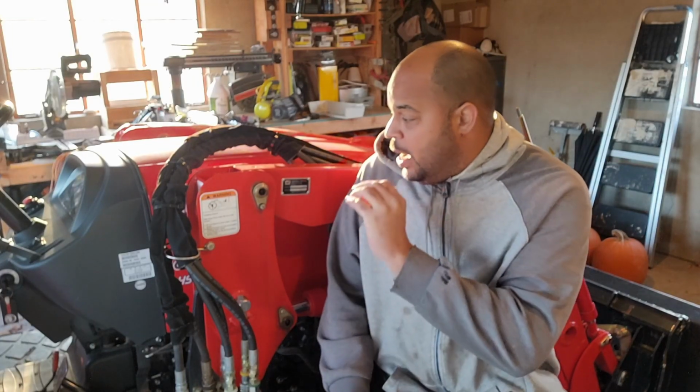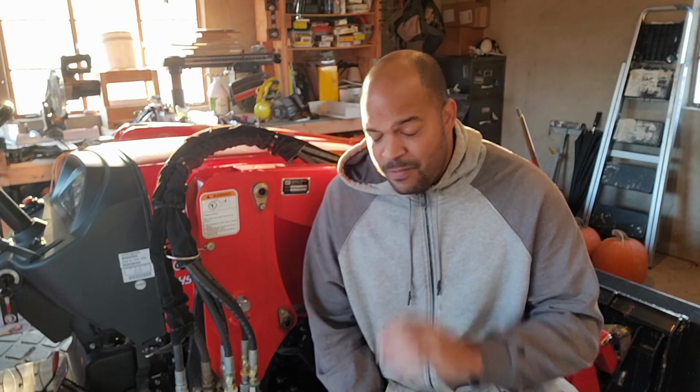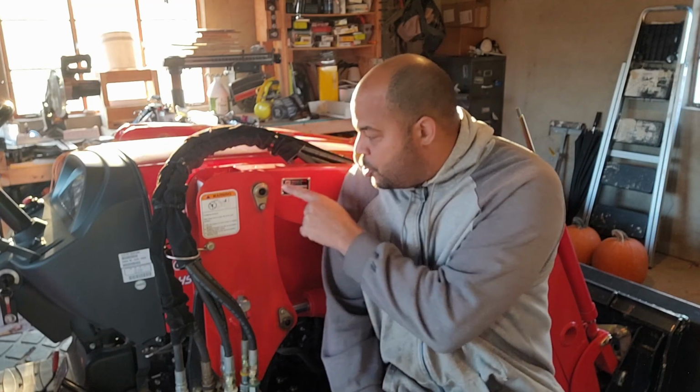And I say that to say this next, because after I check all my oils, and that's on a daily basis, like I said before, I can't stress that enough, every single day rather. The next thing you should do, or the next thing I do according to my owner's manual, check your manual for what yours says, and if I'm missing stuff and leaving stuff out, drop a comment below, let us know, is Zerk fittings, or grease fittings, or however you want to call them. These little guys here, you take a little grease gun to them and put grease into them. According to my manual, I'm pretty sure it says every 10 hours.